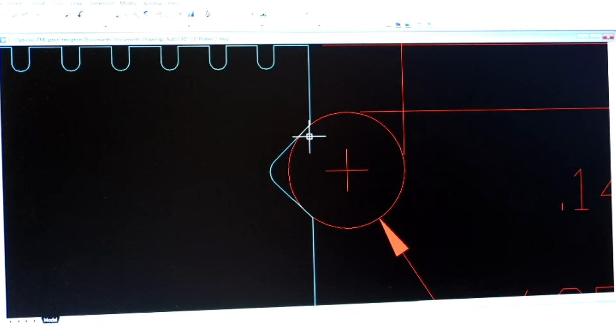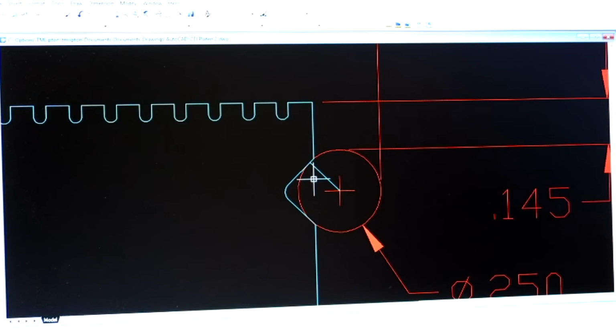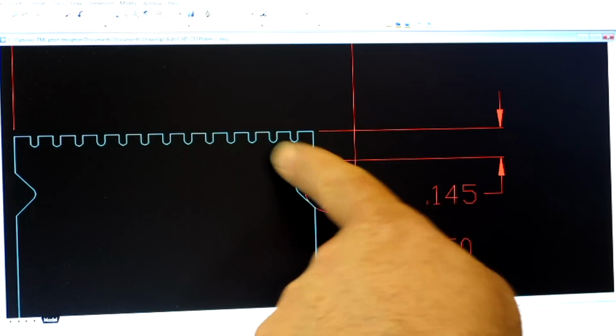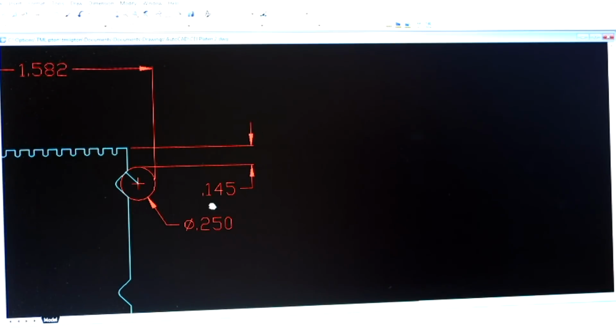Now when that groove's a little shallower though, we run into a little bit of a problem. So let's draw a line from that intersection, and that's the tangent point. It's picking up the tangent point, and then we're just going to draw it to the center of the circle. So you can see there that there's not a lot of room where that thing is sitting properly in tangent. So this pin is a little bit big in diameter, in particular when our little notch is a little bit smaller. Okay, so let's see.